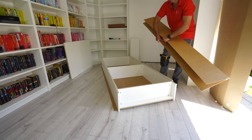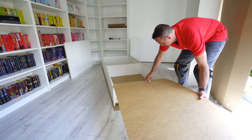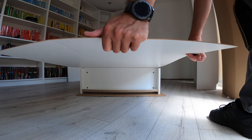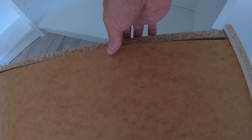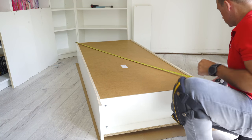Here is the back panel — it's a folding one and quite hard to slip in, but there's enough space behind the bookcase. Find the gaps on the side panel and slide it in on both sides at the same time, pushing all the way in. Mark the middle part because you'll put nails there. Once you reach the middle, lift with one finger to get over the middle part. On the top, lift the back panel up slightly, then line it up with the top panel and check that the bottom lines up nicely as well.